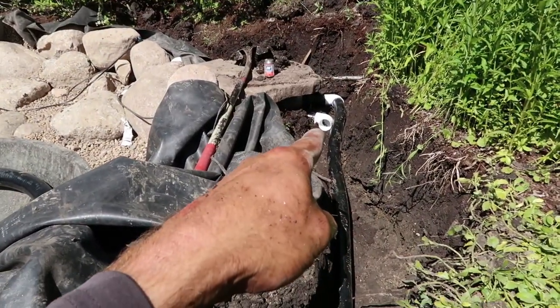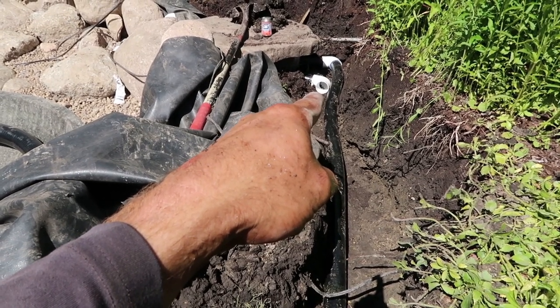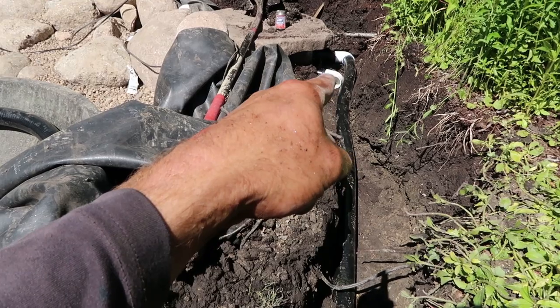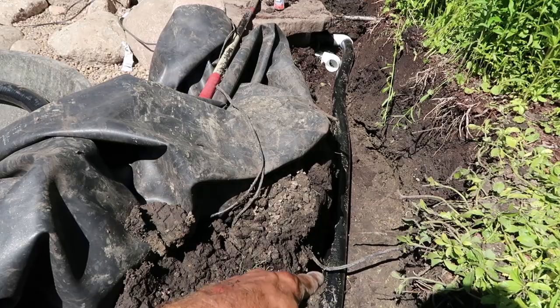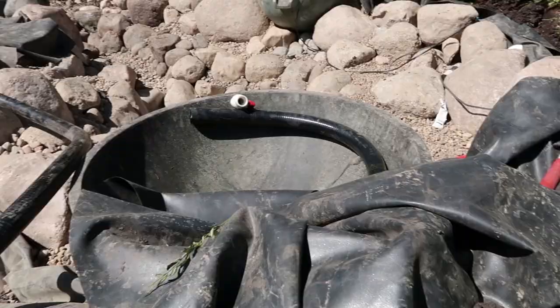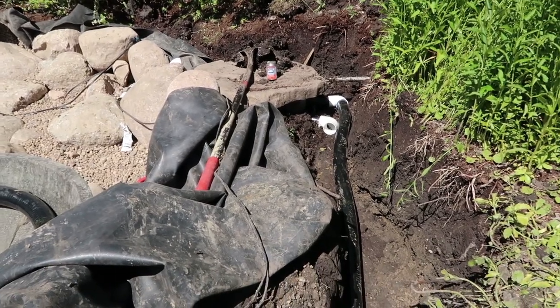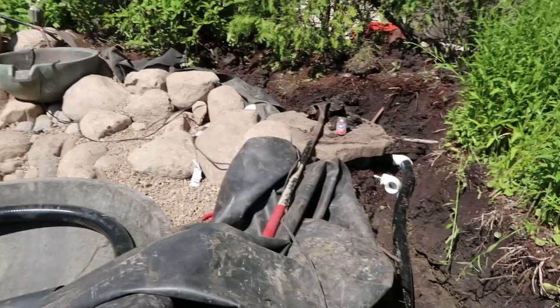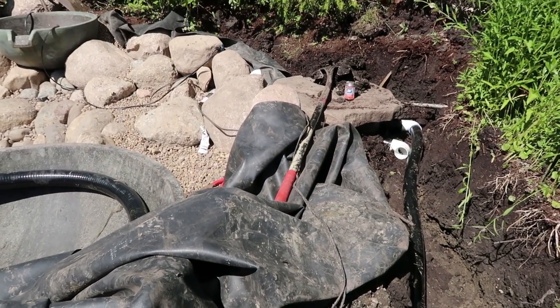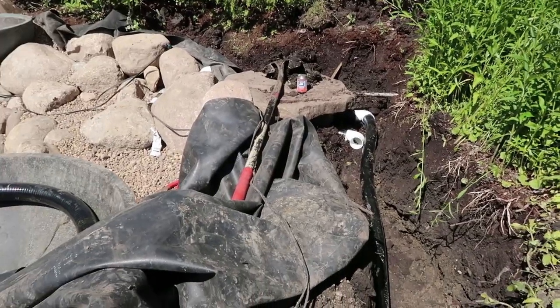The second elbow over there that does not have a pipe attached is going to be for our 3PL pump, which will feed our 6,000 biofalls. I don't have that attached and buried yet, but as soon as I get done covering this pipe, I'll run that line. It looks like we have a bit of a negative flow in the pipe should the pumps ever shut off because of how deep that biofalls is sunk. So when we come and do the fall shutdowns, we will have to blow out these lines and cap both ends inside the skimmer and inside the biofalls, because in our climate we freeze in the wintertime.